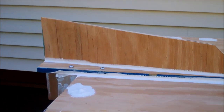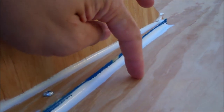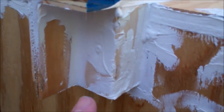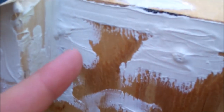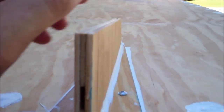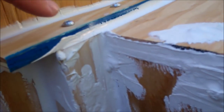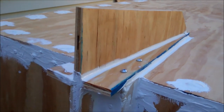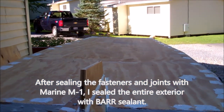Here's the keel assembled. The keel is just the same 3/8 inch plywood the rest of the boat's made out of, and since it runs perpendicular in the field of this 3/8 inch plywood, I wasn't sure I would connect the two, so what I did was I made the keel L-shaped, turns down the block. Here I have little blocks of 2x2 that are screwed through the keel into each other, and then screwed this way through the back of the boat into the internal 2x2 ribbing that runs along this back bottom edge. And that attached it, but it still had some bow to it. So I took these triangle sheets of plywood and I stuck them in, and here they're screwed into this 2x2, and on the inside, again, it's screwed into the 2x2 that's on the inside edge of the corner. So hopefully that'll keep the keel on. The keel is relatively straight and relatively centered, and hopefully we won't end up just paddling in circles.